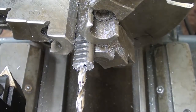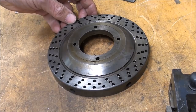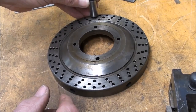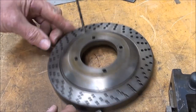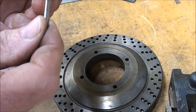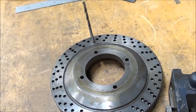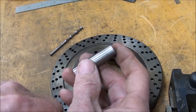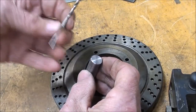That end is done. I'm getting close to the end, although it's a long video. This is the original, broken off, and it was meant to fit into these indexing holes. The size of those holes - this is a drill bit - fits in just nice, but not too tight. I don't want it to where I have to force it in. And that bit is 9/64ths. Often I use drill bits as gauges. So that's the drill bit size. Now I've already faced this off to the correct length. I'm going to put it back in the lathe, center drill it, and drill it this size.